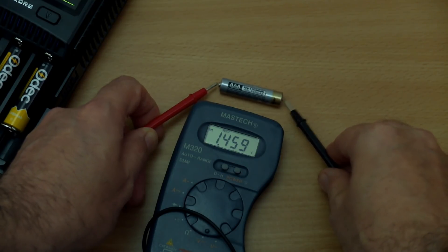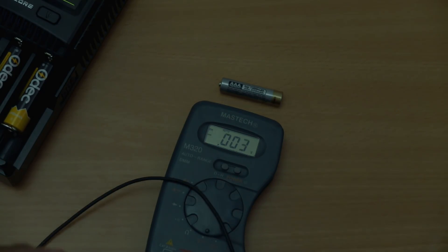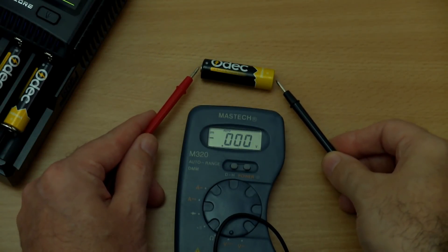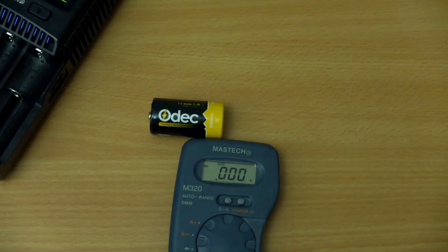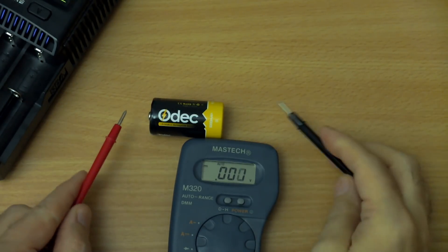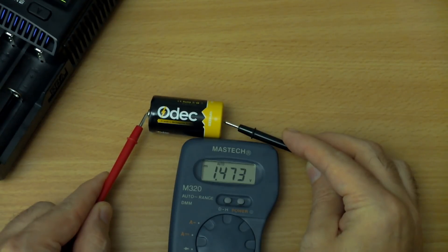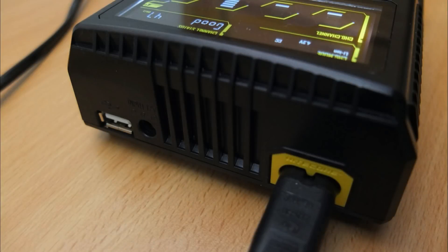Checking the temperature on the AA batteries — no problems there. For NiMH charging termination we're looking for around 1.45 to 1.5 volts; the C cell came in at 1.47 volts. The D4 tends to give slightly higher charges to those cells, but there are no obvious problems with charge quality on the SC4.